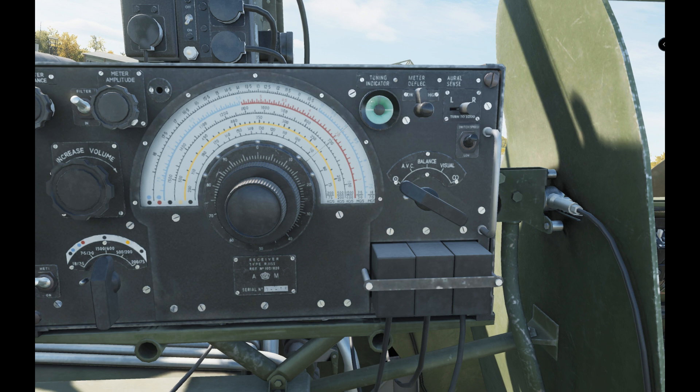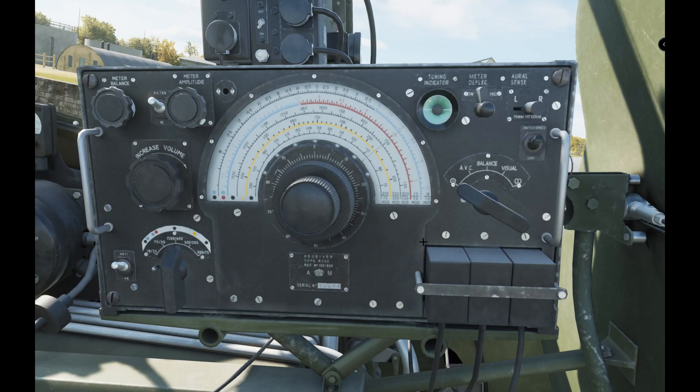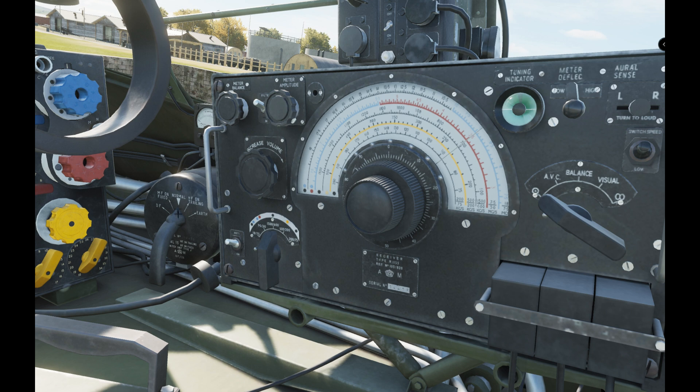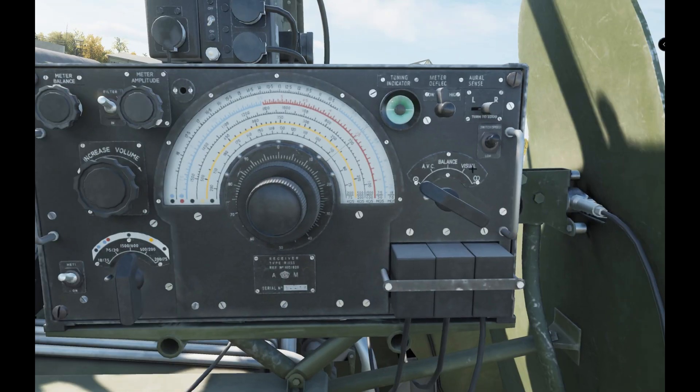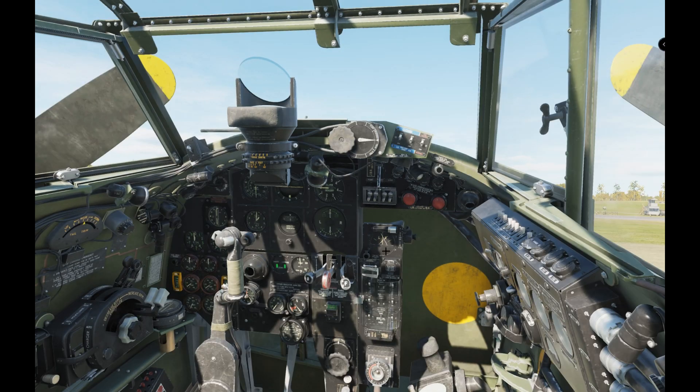That's as hard as this gets just to receive a signal. This is not DF at the moment — it's just receiving. If we want to turn this into DF, we need to do a couple of things. You can see at the moment our needles aren't doing anything. Between these two radio sets there's this control here — I'm going to turn the volume down on that because we don't need the sound — and then we need to turn this selector to 'visual' because we want visual cues.